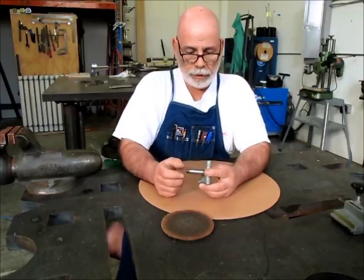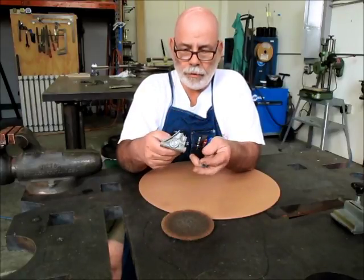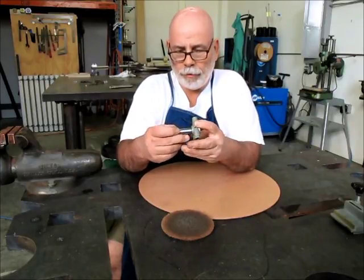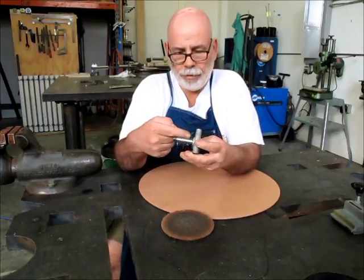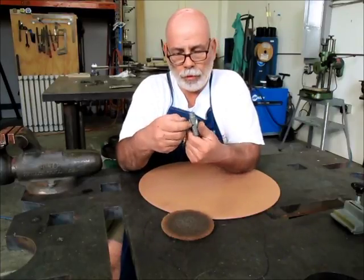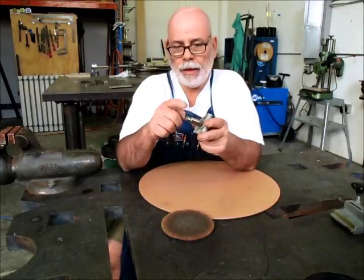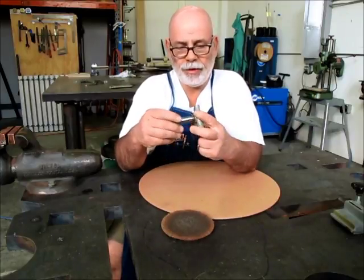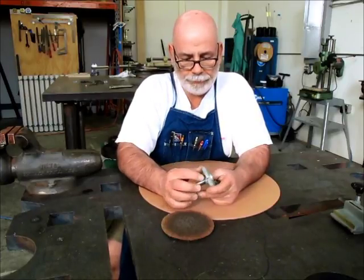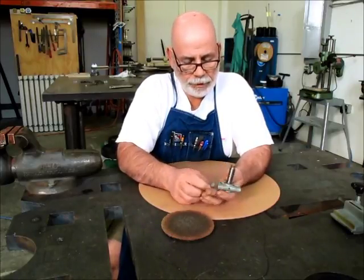This even looks like it's hard chromed or something. I don't know. It looks like it's chrome plated, this shaft. I'm guessing this is hard, or a little bit hard at least. And it sits in this cast zinc housing. And then what they did was they drilled and drove a little roll pin through the thing. And that's the first thing we're going to have to get out of there. I'm not going to make a new one of these shafts. There's no need to. This thing is fine. It's uninjured. It's just the casting part that's messed up. So we're going to get that out of there first, and then we'll take some measurements.